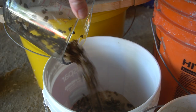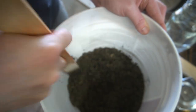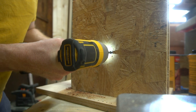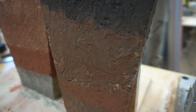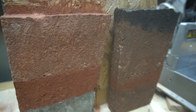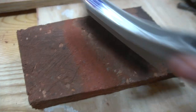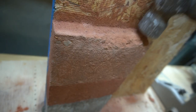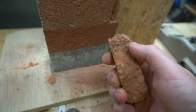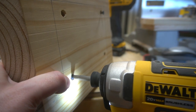He's mixing the sand in the bucket, adding a little bit of color. There's also a little bit of concrete — cement — in there. This table does not live on sand alone. Looking at two test pieces: they look like ice cream, or a poo brownie personally. But it was pretty strong. I did two different mixtures — one more watery where the layers blended together; it was so strong the rock actually split in half. The other one was a little more brittle. After my experiments I decided on one part cement, three parts sand, to two parts aggregate or stone.